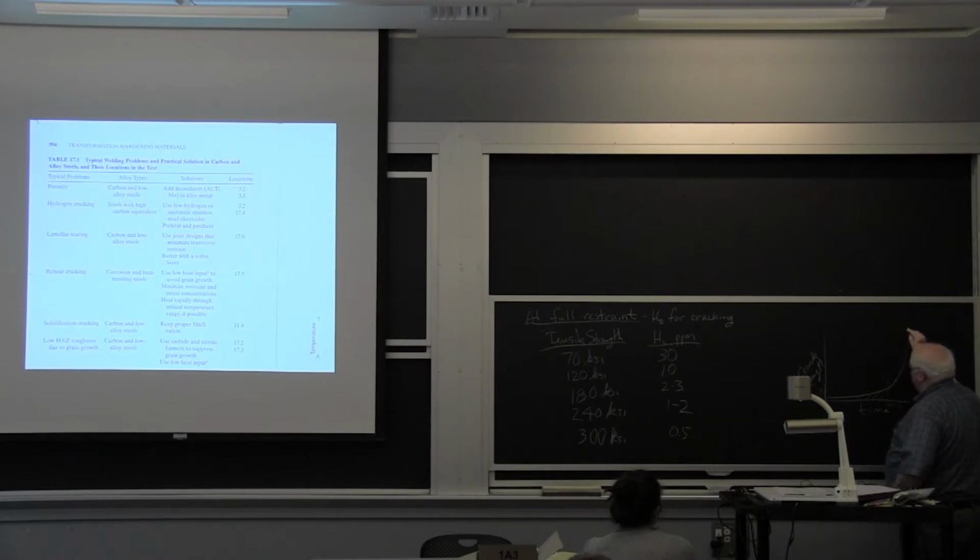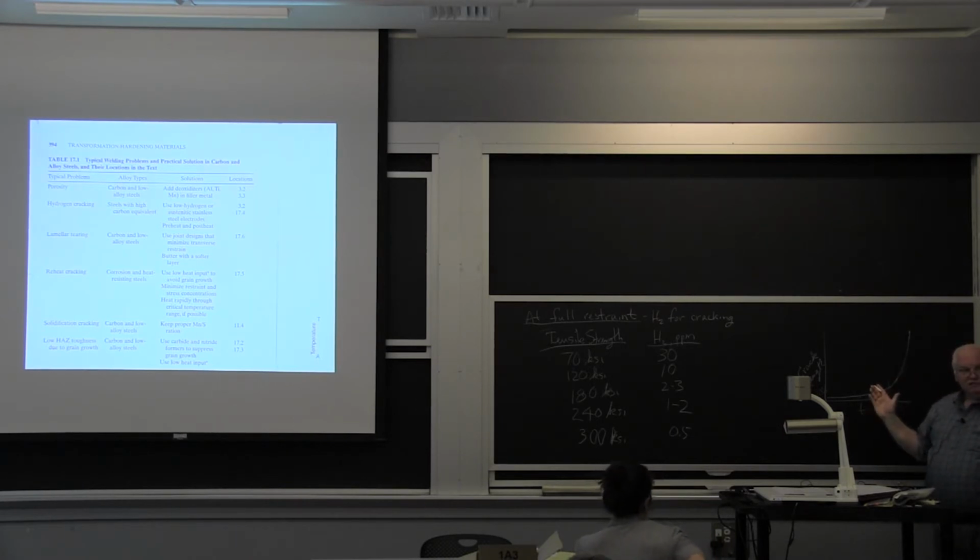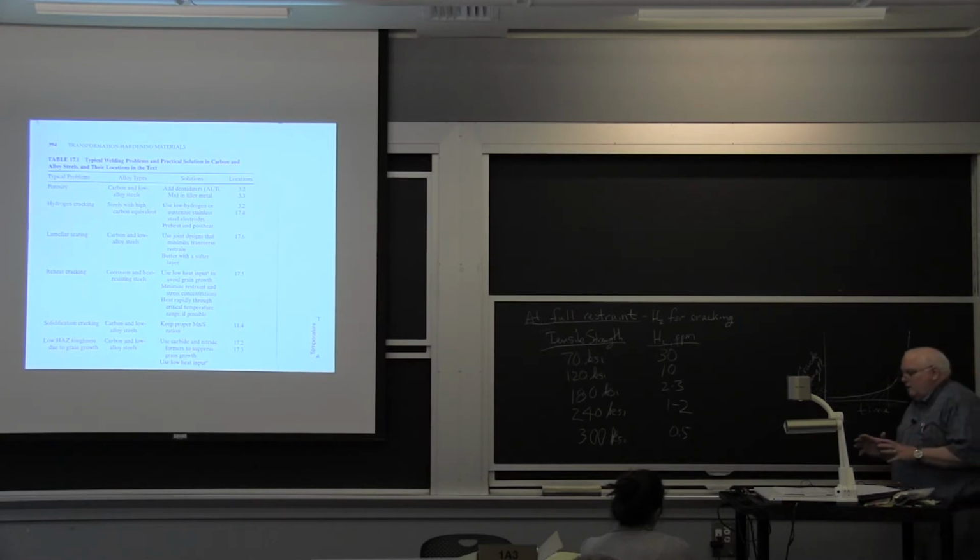And then it starts really going fast, okay? So it grows the last 90% in the last 10% of its life. It's a rule of thumb, maybe it's 80-20 rather than 90-10, but in fact, you've got to find the fatigue cracks when they're still small. So this one, they probably could have found it,